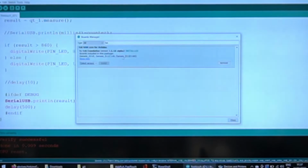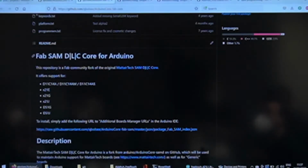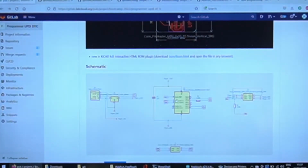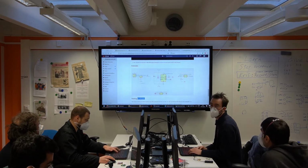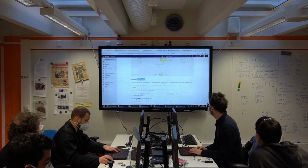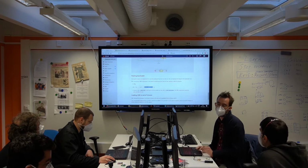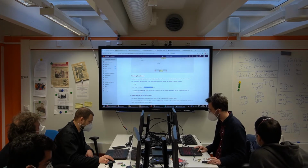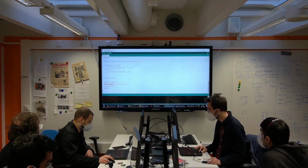This will let you program this SAMD using the Arduino software. So, you know, we're gonna have code in the sketch and launch it to this chip using only the USB port. I'll show you, it's just amazing. But for that you need the bootloader. The bootloader's job is simply to be responsive with Arduino whenever it wants to program through the USB port.